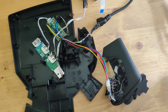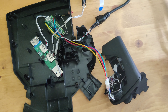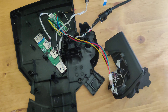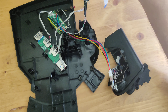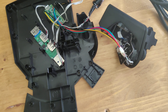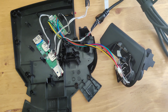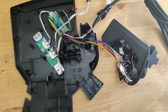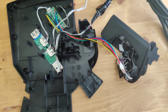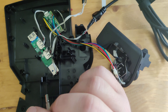For those of you who haven't been keeping up with this: the goal is to take my analog mod and reduce it down to one USB cable, basically feeding everything through the factory USB cable that comes on the device. The stick needs its own PCB and therefore its own USB cable, so historically this mod has had two USB cables — the original factory cable and a new cable coming out of the back. What I'm trying now is embedding a USB hub inside the device.